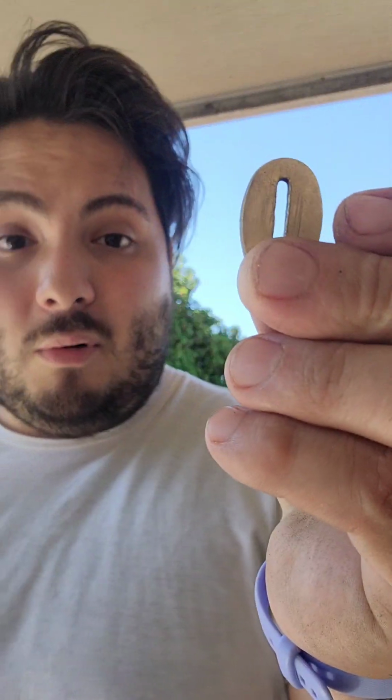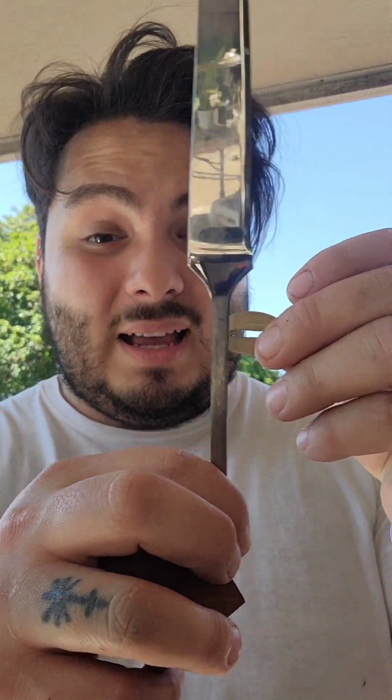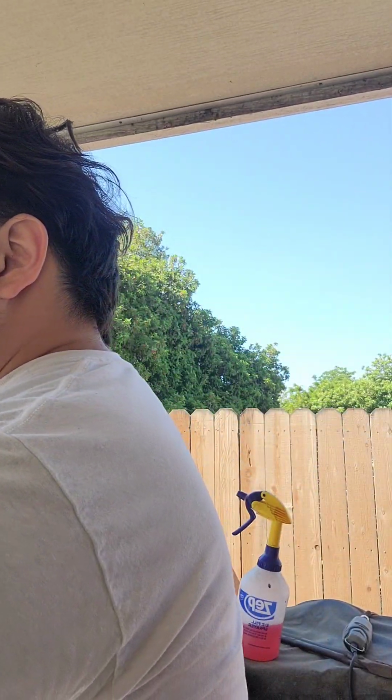What that does is create a slit. So instead of having a drill bit that is this big, because let's say this is a 1/4 inch, if I was to drill a hole that is 1/4 of an inch, that's a lot of meat, especially when the bolster's only that thin. So it would be a significant amount. This is better, and overall has a tighter fit, less wobble, and the mock-up or the glue-up is going to be much more efficient. And you have more material to adhere to each other. A lot of people just use a nice big hole, like I've seen Condor do that. But now I do this. Let me show you.